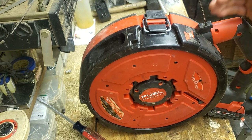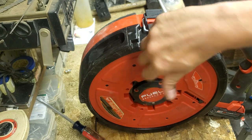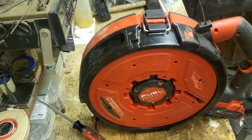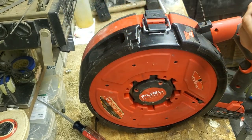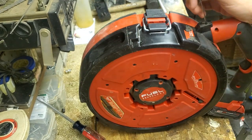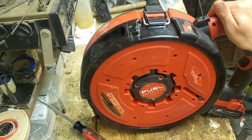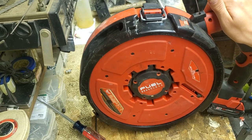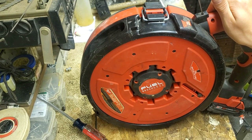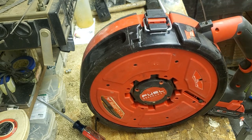At the end of the day, a fish tape is something you need to be rough with sometimes. You've got to get it right on the end of the conduit and spin the whole thing around so it snaps and spins inside to get past a coupling or around a 90-degree bend. I used it on underground inch-and-a-quarter PVC conduits jumping parking lot lights — and that was my first mistake.